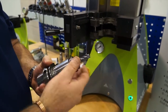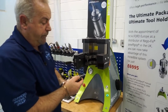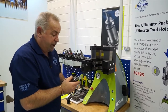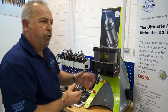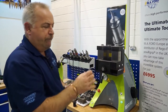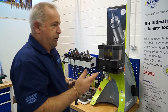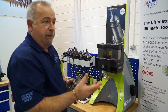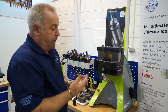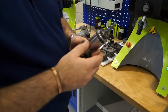As tests have shown, that's 50% more gripping force than heat shrink. One of the issues with heat shrink is if you have three identical holders in your rack and because they've been heated up and cooled down, they're all brown, they're all the same colour — you can't tell which one's been heated up three times and which one 200 times. Also with heat shrink, if you buy an 8mm heat shrink holder, that's all it will hold. With a power grip system you get much more gripping strength, but you have a collet system, so the holder will hold a variety of diameters.